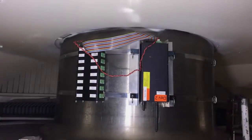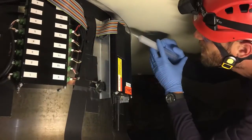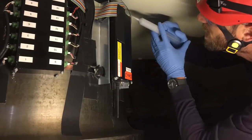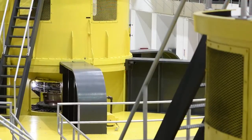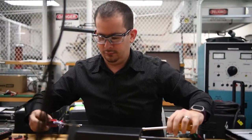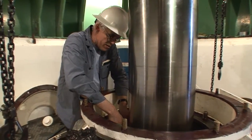Presently when we're looking at powering these sensors on the rotating shafts, typically we're using battery systems, but those batteries are limited in size and the weight of the battery as it gets heavier puts constraints onto the banding we're using to attach it. If we were to go to slip rings or other induced voltage methods, the setup time is prohibitive — it's not very easy to set up and it takes multiple outages.